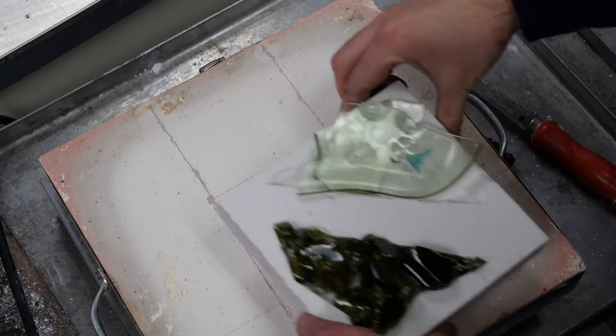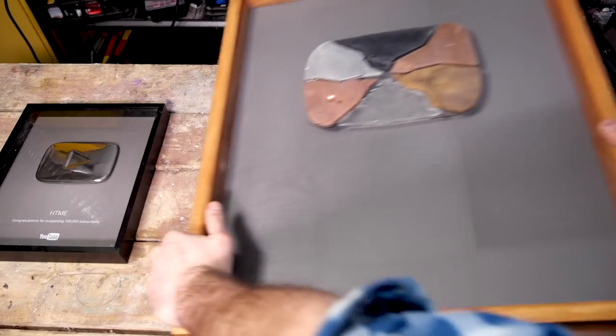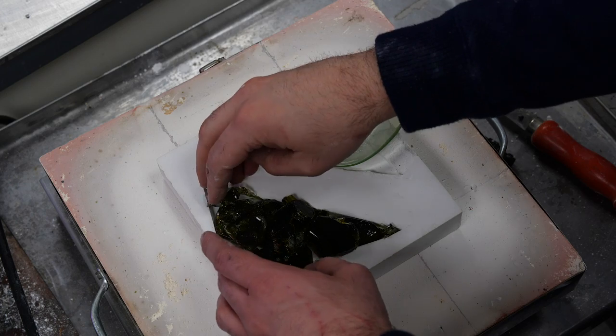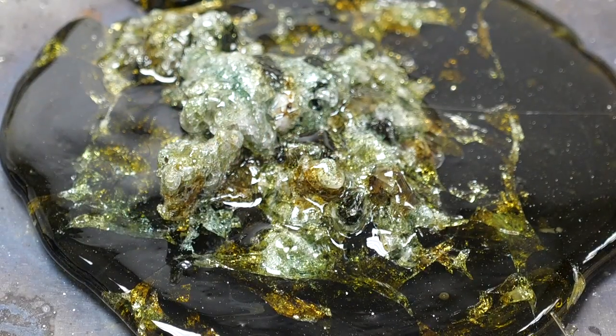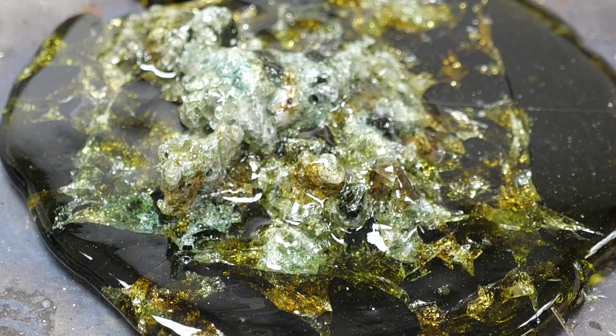Later, I revisited obsidian casting for the custom play button I made and used a different technique, a mix of sand and plaster for the mold, where you then melt the shards of obsidian into the mold, which requires a little less flux and heat.